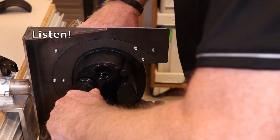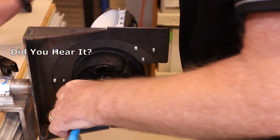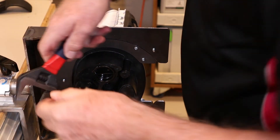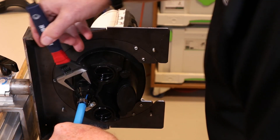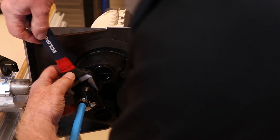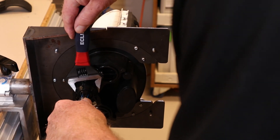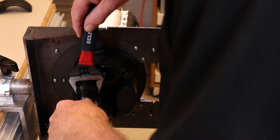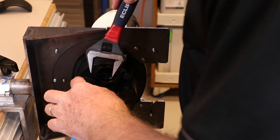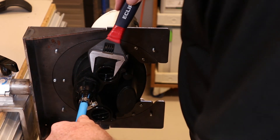I'm going to push it home — hopefully you can hear the click. Then just to make sure it's tight, take the shifting spanner that you were using before and just tighten it a bit. You may just get a little bit on the nut here — less than a quarter of a turn is all you need. That makes sure this nut is absolutely tight and that it won't come loose in service. And that really is the end.